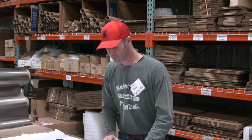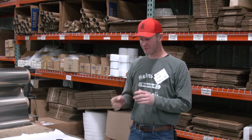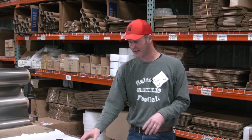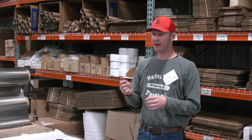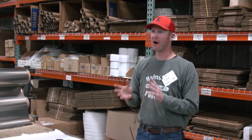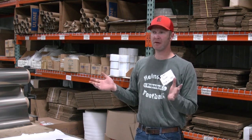Just before we go any further, you talked about how stiff it is initially until you break it in. Do you break it in before it goes to the customer? Yes, I do. I always break in my knives because I'm very particular about my actions. This is one of the only knives I've ever built on bearings, because it's an integral and that's just how I wanted to set it up. But I do all my own washers, and that's just what I prefer. I just prefer the feel of a washer knife, and it needs to feel like glass on glass. I always like to break mine in before it goes to the customer, because some guys will break them in themselves, no big deal.